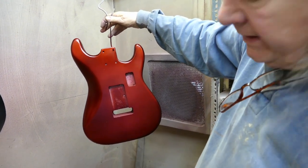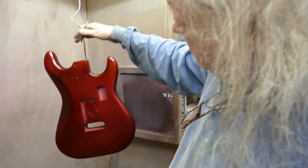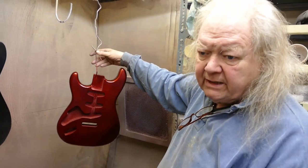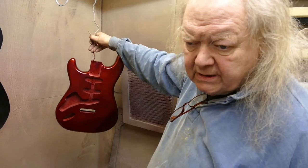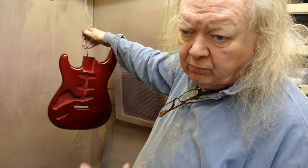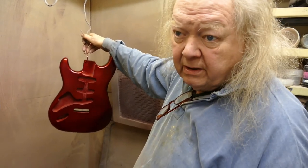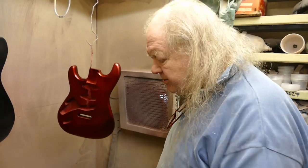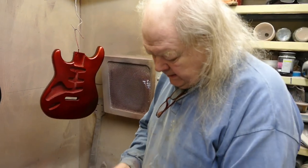The way of achieving this — and I'm still doing it — you have to spray on the coats, sand it all down, and keep sanding down coats. The first two or three coats are very fine sanding sealer, basically to seal the wood so that if he changes his mind about colour or wants a see-through guitar in the future, it can be scraped off and you can get back to the wood.